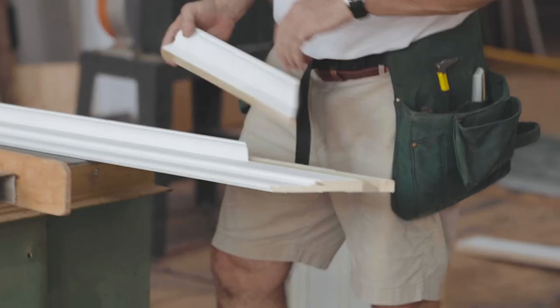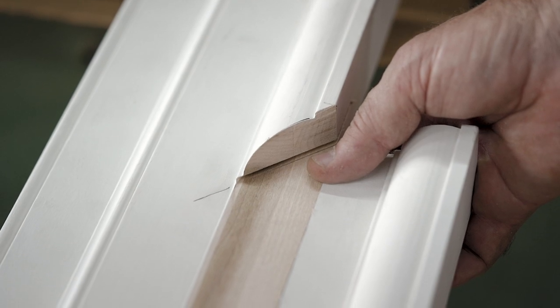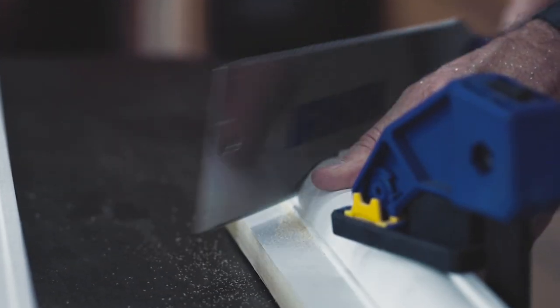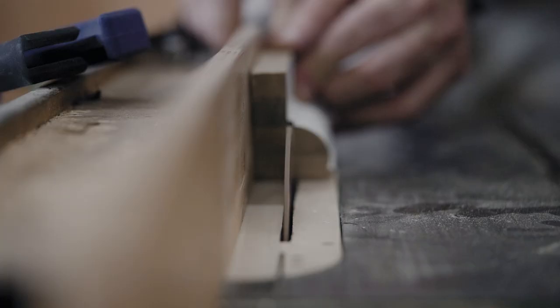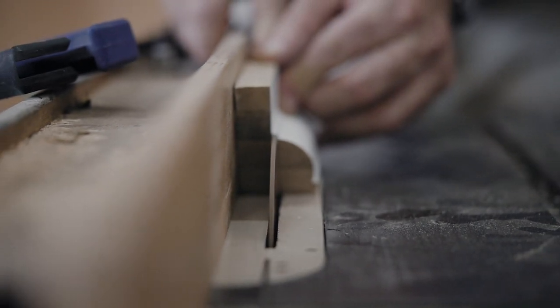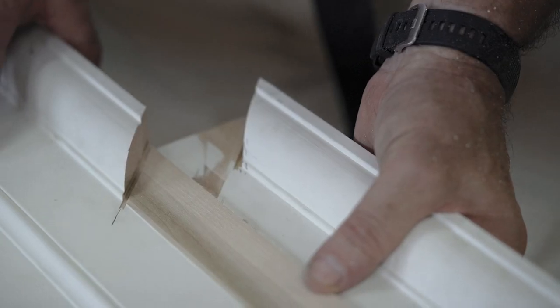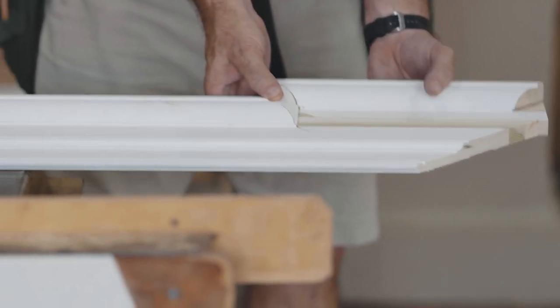So now I've got my block right on the backside. I've made space for myself here so that it allows me to cut my 45 back, come back this way. As I cut off a piece of the molding, as you saw, and now I've mitered the top of it to accept this piece here, which goes right in there, which is what kicks us out the inch.